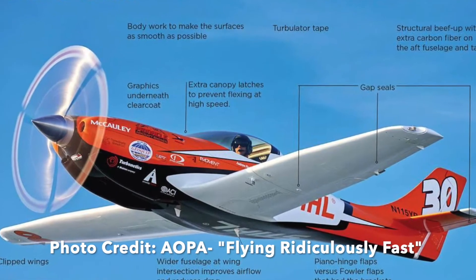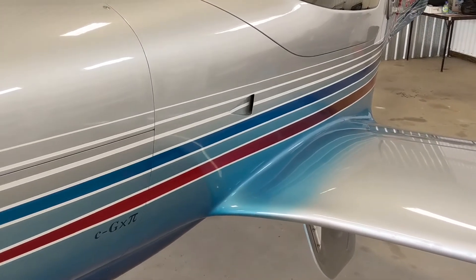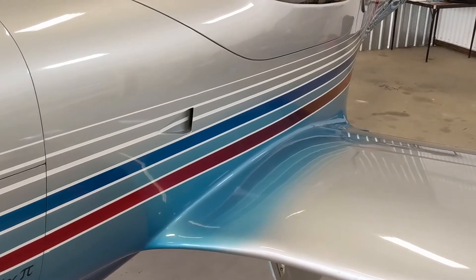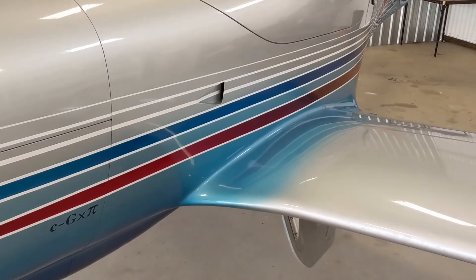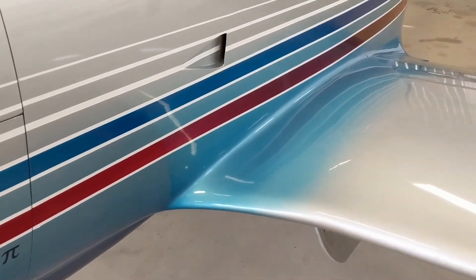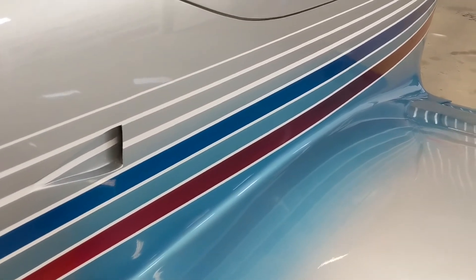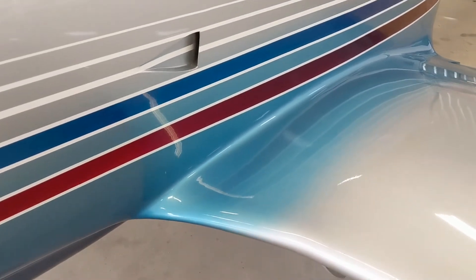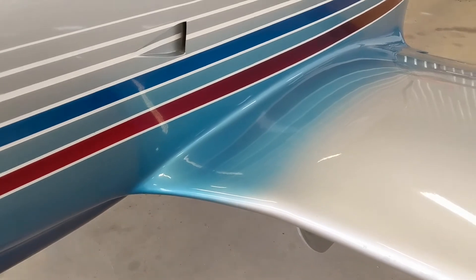It's one nod the Legacy gives in the direction of speed. Moving on to the wing — this is one of the more beautiful aspects of this aircraft in my opinion. There are very few compromises in this airfoil in terms of efficiently achieving high speeds. At the wing root, you can see there's no exposed bond between the wing and the fuselage; the root is one piece, bonded directly to the fuselage without any gaps — seamless and smooth, which is one of the advantages of working with composites, either fiberglass or carbon fiber.